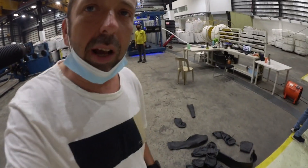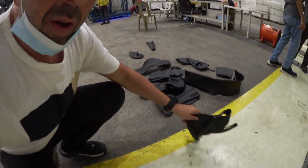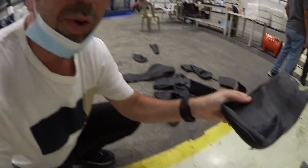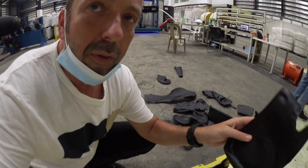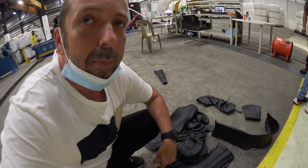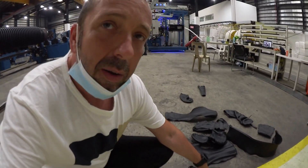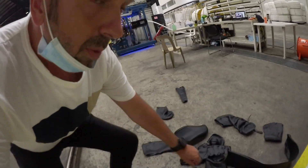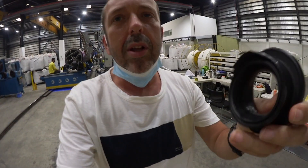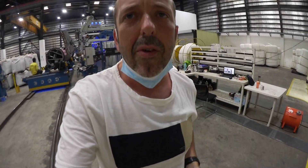I just found something nice for you. This is usually the starting scrap — to start a line you produce maybe three or four kilograms of scrap for every pipe you do, regardless of the pipe size or the profile. Compared to traditional extrusion it's not a lot, but the question is what we do with this starting scrap. It's very important to keep it clean and free of dust because we will reuse it in our own process.